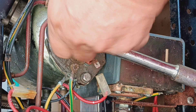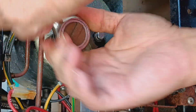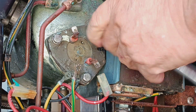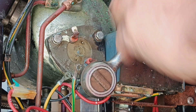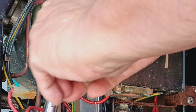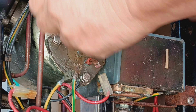As you get closer and closer and the tank starts closing up, you want to go gradually and evenly around — turn each screw about two times, then go to the next one, and so on. You don't want to tighten it all the way on just one screw or you'll crack the plate.